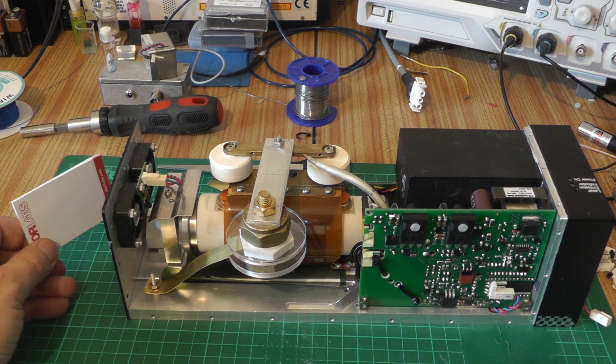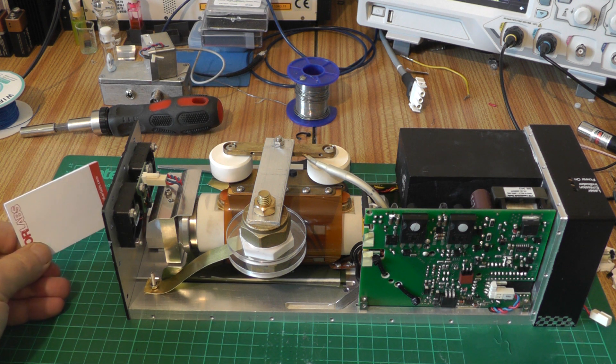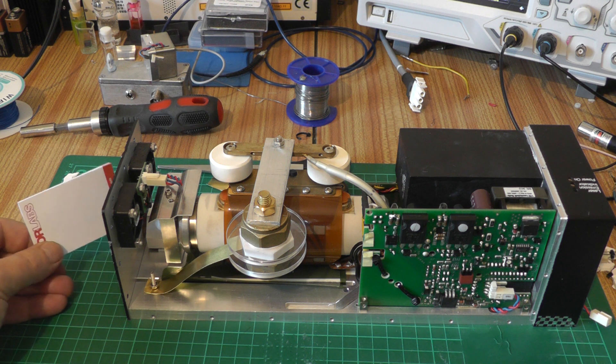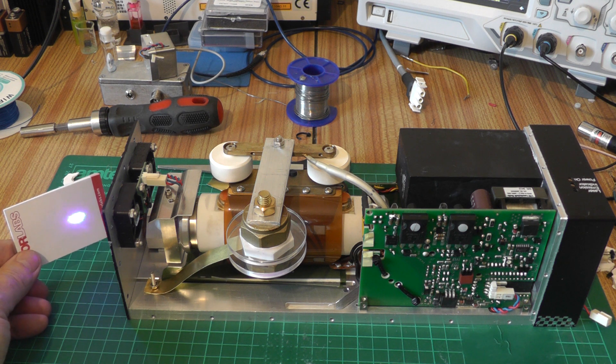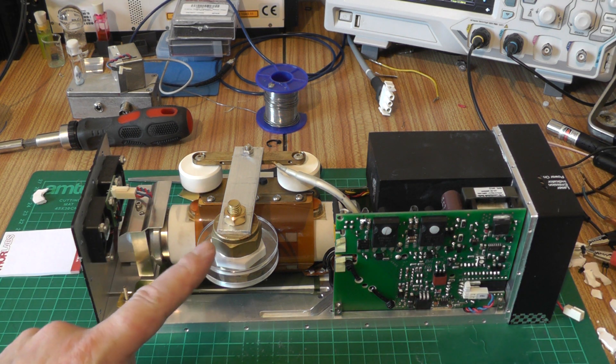I've got the spark gap connected — a large flat piece of aluminium to the top rail and a brass strap grounding the opposite end. We'll power it up, get a paper target, see if we can see any UV. Let's come around here and switch on the power supply. Absolutely fantastic — a very very nice bright ultraviolet output. Let's see that again because it was awesome.